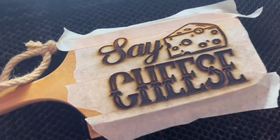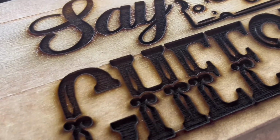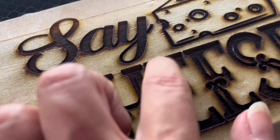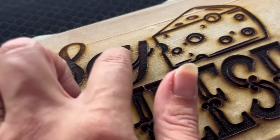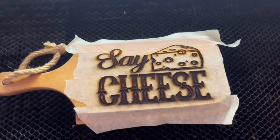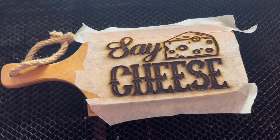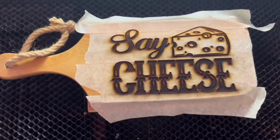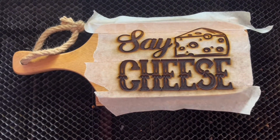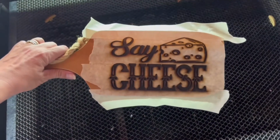Once your laser is done engraving, make sure that you don't remove your board just yet until you have checked that the depth of your engraving is deep enough. If it doesn't feel deep, you should engrave it again and it will have more depth. But once your depth is okay, remove your board from the laser.